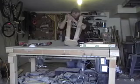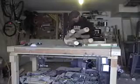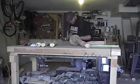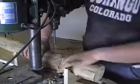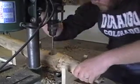And I label each line with a 6 or a 9 depending on the height of that spindle. It's really important to minimize the number of times that you take the bolts in and out of the wood. So now I'm using those lines I drew to not only show me where to put the hole, but where to aim the hole.